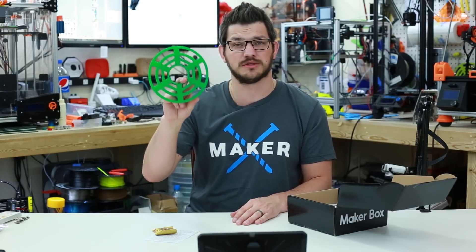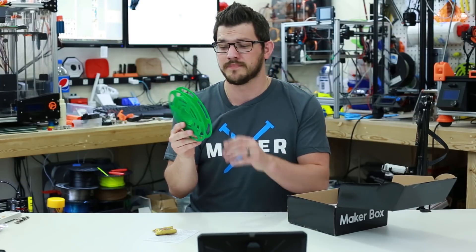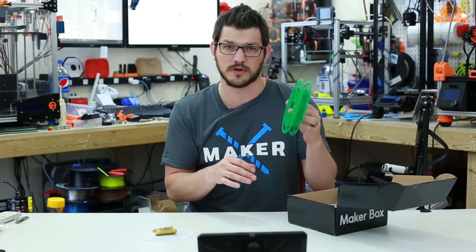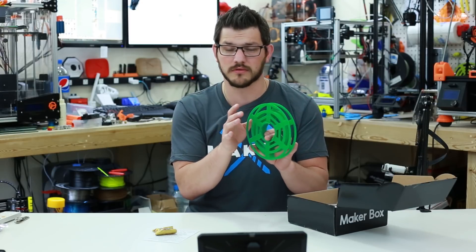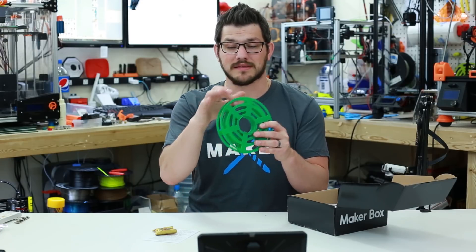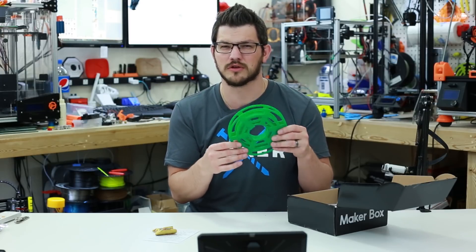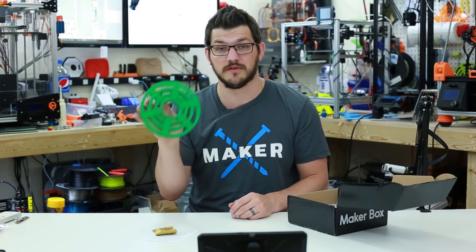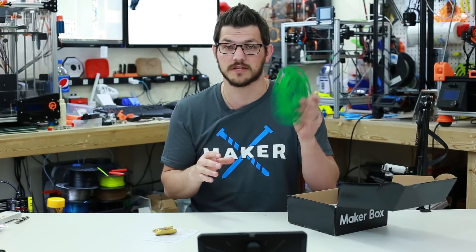The last thing is the spool I'm going to use. This is a redesign from a previous model — I gave suggestions in my earlier video to improve the tolerance, make it more printable on a standard 200 by 200 millimeter bed, and to make the center ring larger so the filament doesn't float too much. So this is what we'll test out this month — if you want to try it, there will be a link to the Thingiverse file in the description. Let's roll some time lapses and get these things printed.